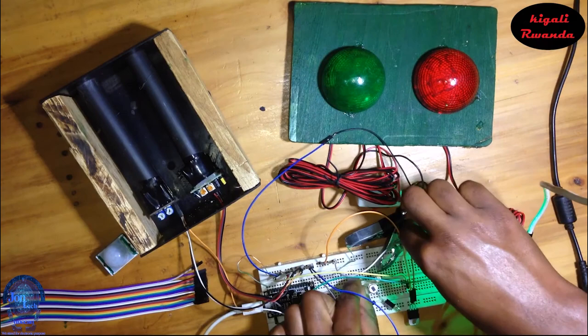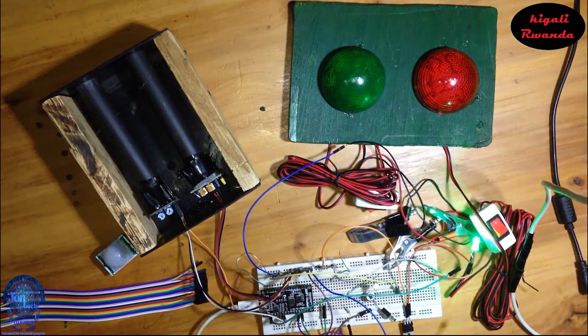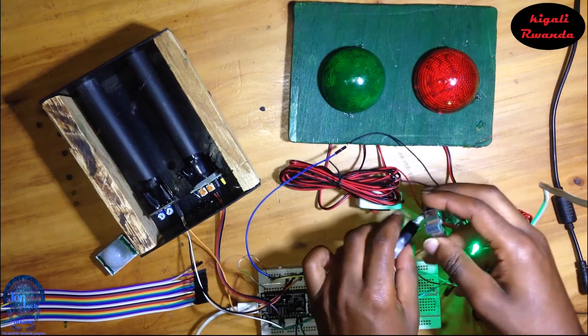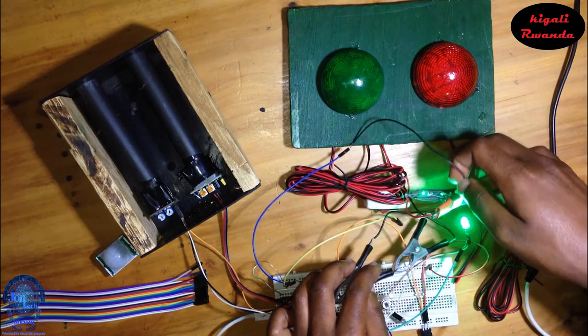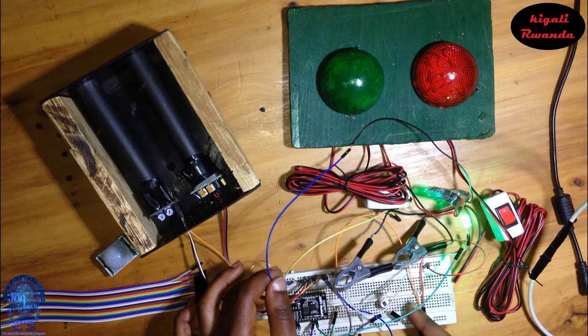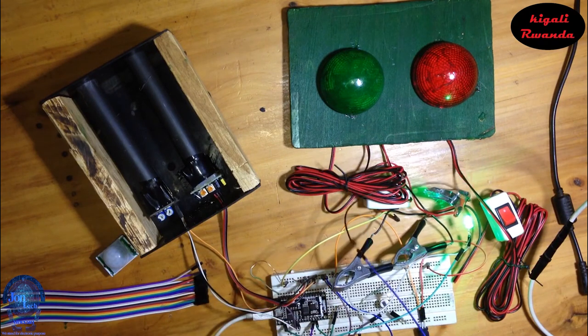I managed to change the sensors and effectively I am able to detect the body from a long distance, as these motion sensors are dedicated to long distance operation. But considering the fact that they can sense in a 180 degree angle, I used 10 cm pipes to make the waves sense straight in order to avoid interference between both motion sensors.